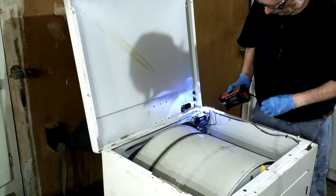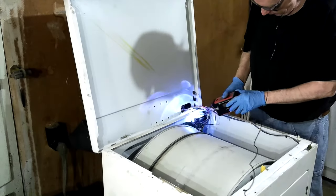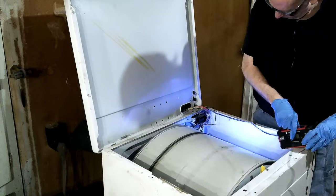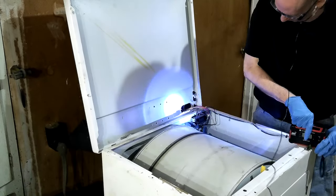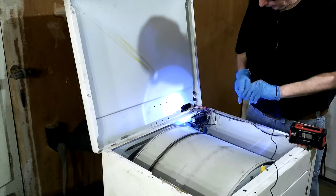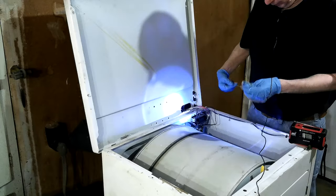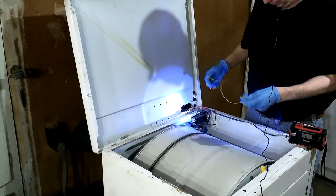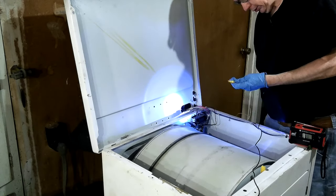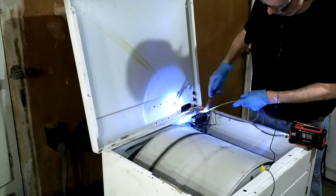I should have got a light with a clip on it. The big lights I have make so much reflection I can't see anything. Maybe that'll give me just enough light to see what I'm doing. It's not a real big wire, but I'm not going to leave it on. If you do something like this, don't leave it on more than just a short time, especially if you're using small jumper wires — small gauge — because they will burn up.